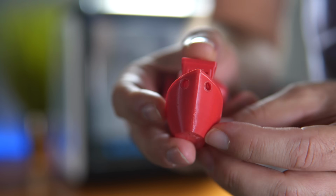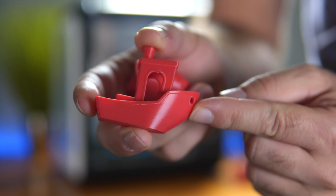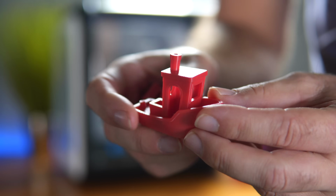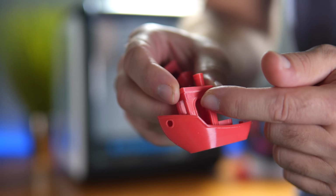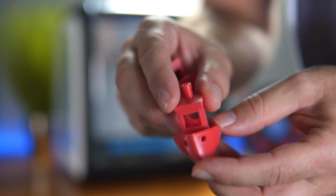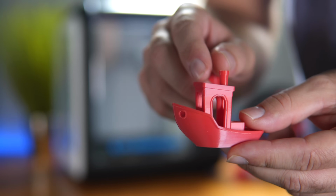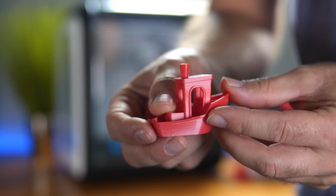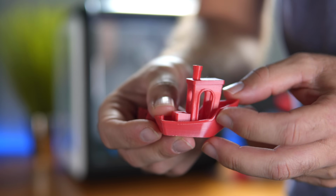Basically almost perfection. So we do have the same issue here, and that is definitely stitching from the slicer. So you can see how good this printer is at walls especially. This printer is excellent at walls. And the overhangs for the most part are good, but the layer shift is actually right at that area. So I'm thinking that that could be better if everything was fine. So I'm pretty sure the layer shift up here is caused by a corrupted file. And maybe the way I brought in the file and unplugged the USB corrupted it, I'm not sure. So if we just ignore that shift, everything else looks really good.